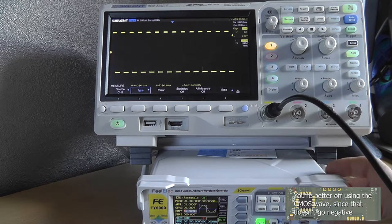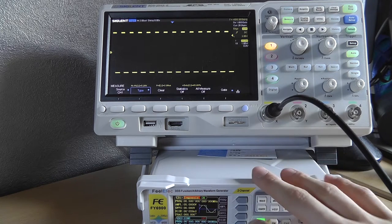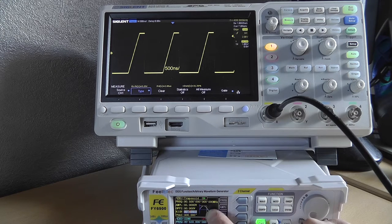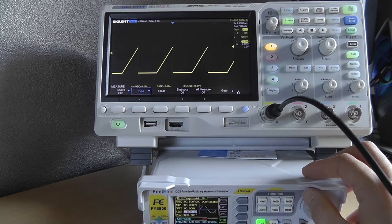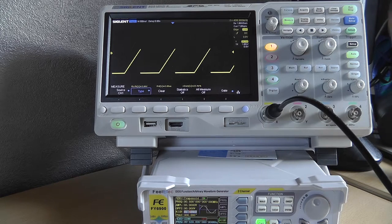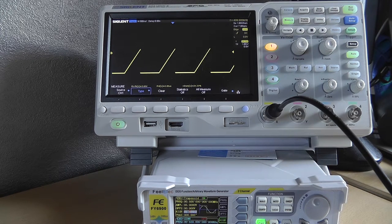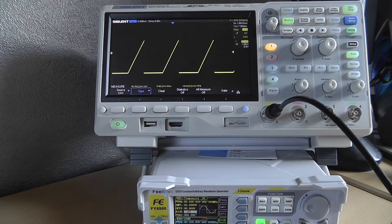You can also adjust the phase. There's a trapezoid waveform where you can set the rise time — currently at 8 nanoseconds, but the screen isn't updating to show a trapezoid. Up until you cut into the waveform the rise time affects the amplitude, which is a little questionable — I'd expect a steeper angle while preserving amplitude.